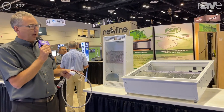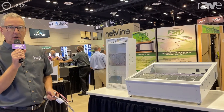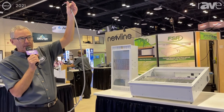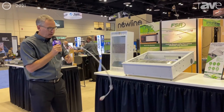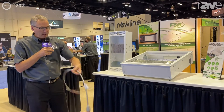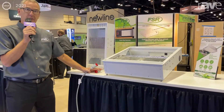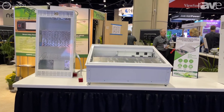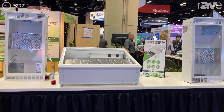With the MLS family of ceiling boxes, the electrician comes in prior to the install, installs a starter cable in the ceiling over the box, and when the AV integrator arrives, all he needs to do is plug this cable right here into the cable on the ceiling box and all the power is provided. It's a one-stop installation for the AV integrator, saving money and saving time.